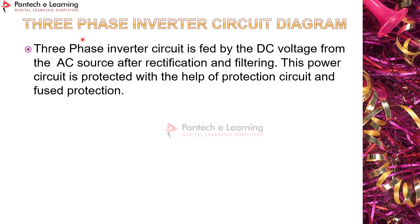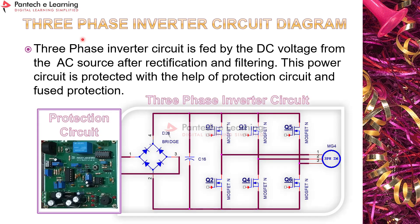We use a three-phase inverter circuit fed by DC voltage, which is converted to AC for the load. The protection circuit in this prototype has a reset switch — if there is an overload or short circuit in the inverter circuit, the trip is enabled and the DC source is cut off from the inverter. After reducing the fault, you can press reset to reconnect the DC voltage.